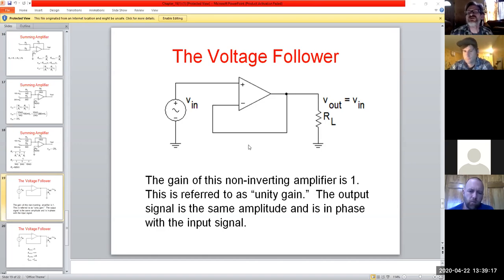And that's generally why they use a circuit like this with the voltage follower and set up something they call unity gain. You'll also see this in the spec sheets, where they have a unity gain circuit. This would be to determine the overall performance of your op amp, kind of like a tuning circuit to see how well it will perform with given frequencies or given amplitudes. I'd be deciding, okay, I'm going to be running these kinds of frequencies, let's see what the response is overall, what kind of heat I generate. That's when you would set up a circuit like this to test the device.